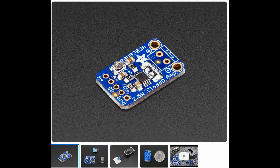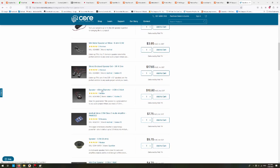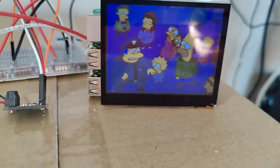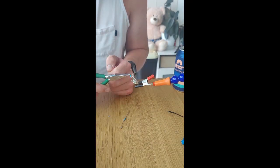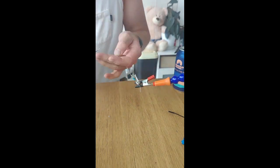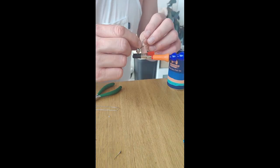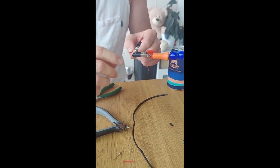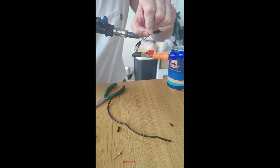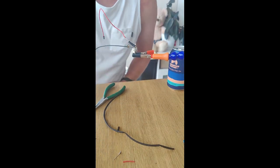When getting the speaker and the audio amplifier, you've really got to keep in mind your power requirements. A lot of this stuff just runs off 5 volts or 3.3 volts, so you're really going to have to find the smallest speaker you can — like this one here is pretty good, just get that one. Then connect it all up using a breadboard just to test it. The original creator used a Raspberry Pi Zero with a pulse width modulation output for the audio signal. I couldn't get that working, so I just did it my own way. I took the stereo output from the Raspberry Pi, soldered in a couple of resistors on each leg and joined them at the end — basically making it a mono signal. Then that went into the input of my audio amplifier, then the output went to the potentiometer which acts as the volume knob, and from there it goes to the speaker. That's definitely not the best way of doing it and I don't even think I had the right value resistors, but it worked in the end.